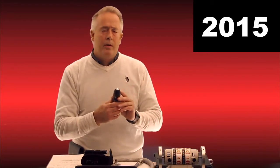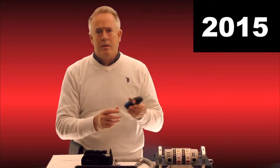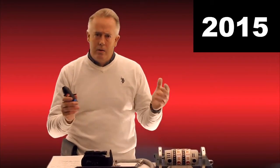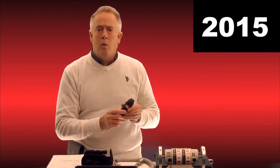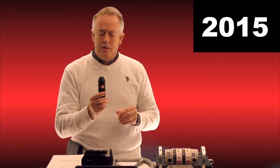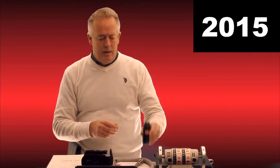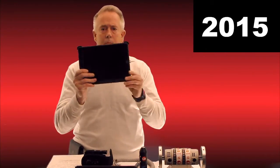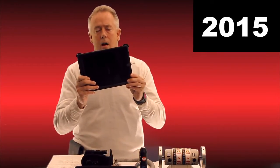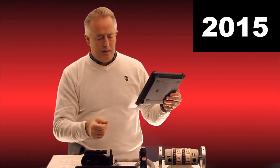The initial prototypes went out to customers who have been very pleased with the unit, especially in dangerous situations — balancing fans, closing machine doors during routes, and being in areas where you wouldn't be comfortable with a corded device. This is one of the first wireless accelerometers on the market for the route data collection type device. The iPad, still in its protective case, has the receiver built into the back end for the wireless accelerometer.